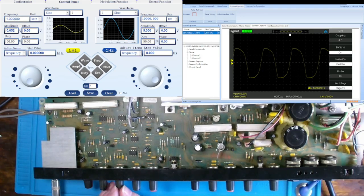Now our sub control is going to try to shape this a bit. You see how it rounds out the top? Almost like we're getting back to a square wave. So you can see how the sub control is shaping that signal. Now, we'd probably see something a little more drastic if it was down at the 80 hertz frequency range, but that is what is occurring there. Now, again, my sub, focus, and lead are currently fully counterclockwise, so I can demonstrate this to you.